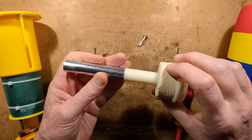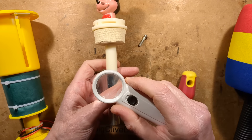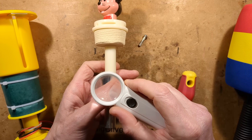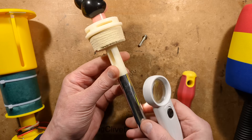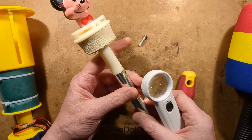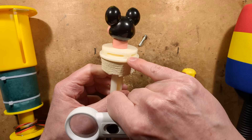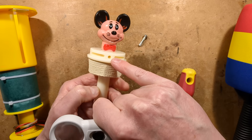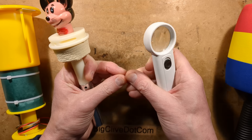There is what looks like a split ring — actually it's a grub screw going in through here to lock it into the plastic. And this metal tube is basically the solenoid core that's going to go up. There's the other hole indent for drilling that they haven't actually done. I guess this may actually be self-thread cutting.